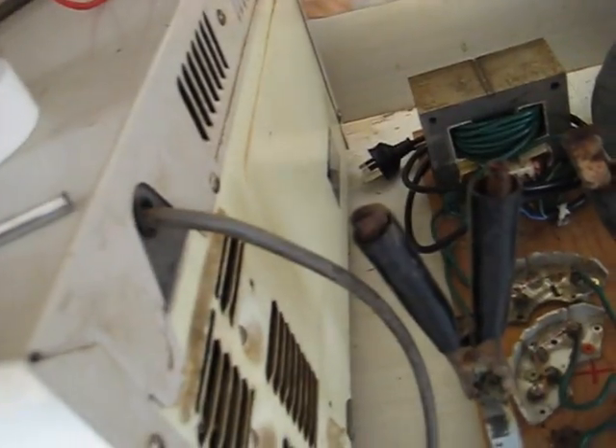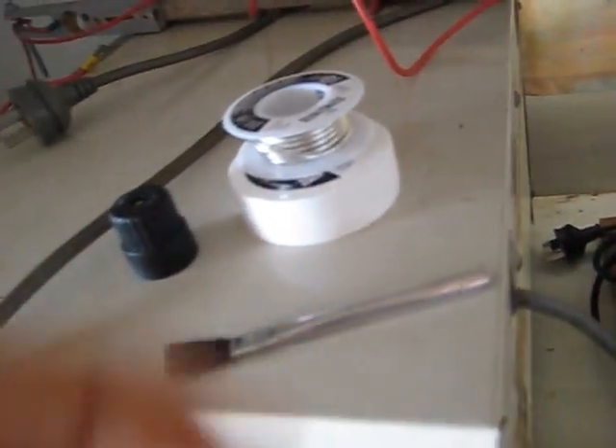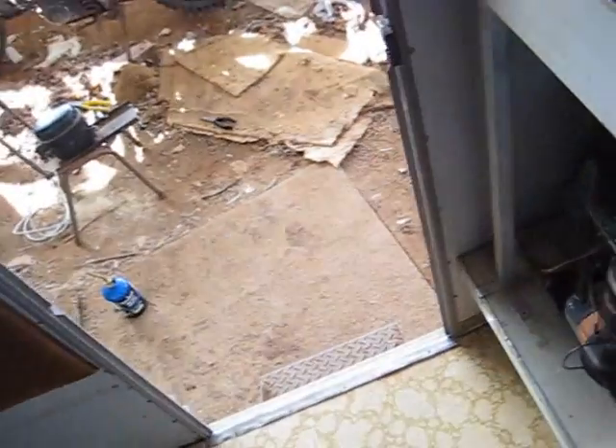The next challenge is getting that really clean and soldering it — that's the major challenge of soldering, is getting a good clean joint. Because this one here — I'm going to use some Silphos. It's like this except it's a bronzy colour and it's coated in a blue flux. It's self-fluxing, so it doesn't have to be so clean when you use that.